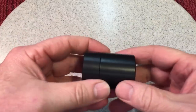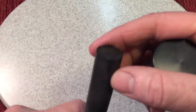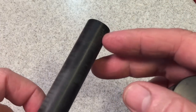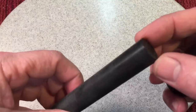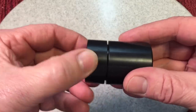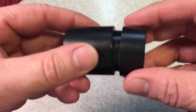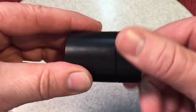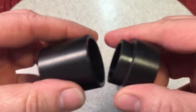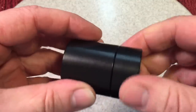Hope this helped. Here's a project I made years ago when I was doing some experimenting with the lathe. This is from a piece of Delrin. Delrin is a very high-density, superior plastic — really a great product to work with. It's thermally stable, super strong, easily machinable, just great stuff. Here's a little case I made. If you notice, it doesn't just open — it almost pulls back on its own. And that's because I made this into — listen to this — you hear that fit? If I try and push this together, it's almost like I have to spin it because it's almost an airtight fit. This is one of the things you practice with — a great material and a lot of fun and good practice on the lathe. Start with plastic, then you can do this in aluminum and brass and things like that. But Delrin is so cool — look at that finish, isn't that beautiful? I tried this out in the cold and it works just the same.